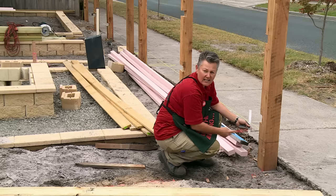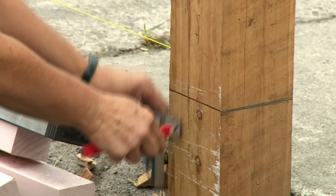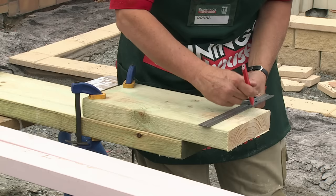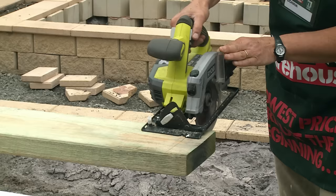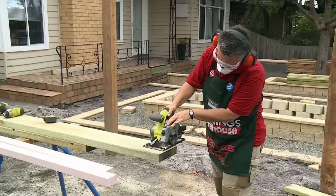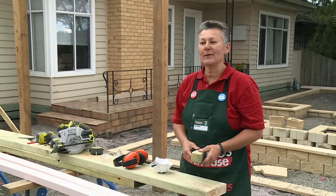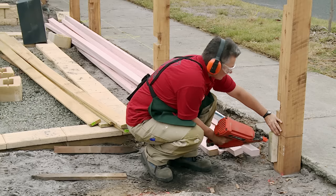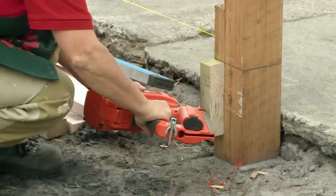Now that I've worked out where the top of my plinth will be, I need to work out where my fixing block is going to go. I'm going to measure off the same distance as my rail and that will be where my fixing block goes. The next step is to cut a block and fix it in so I have something to attach my plinth to. You could use anything as the block but I'm going to use an off-cut of the treated pine. When you're using treated pine, always use a dust mask. Now we can nail this block in place and start the set out for the plinth.